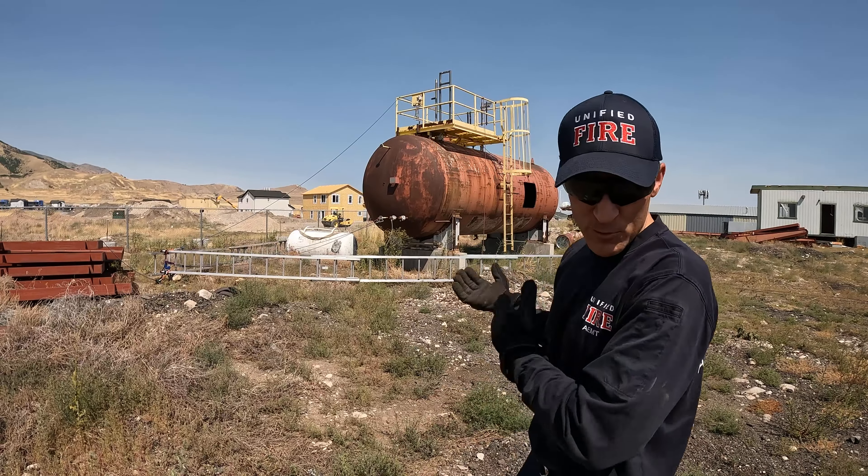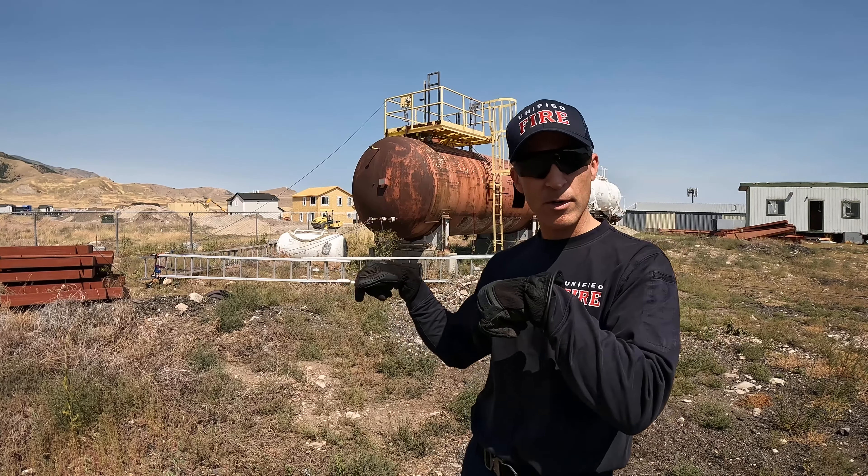We're also pre-plumbing our guy lines — our lateral guy lines. The midpoint of our 200-foot rope is right here, and then we just jump — this is our jumper — to one guy laterally, and then a mirror image of that with another guy laterally on the other side.